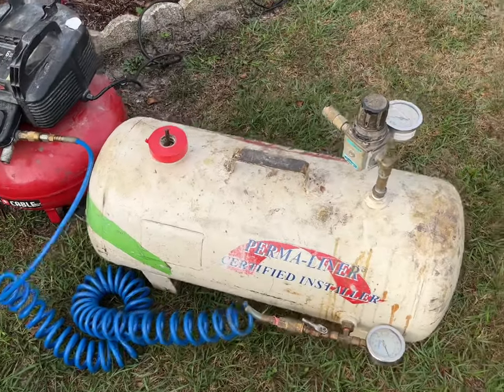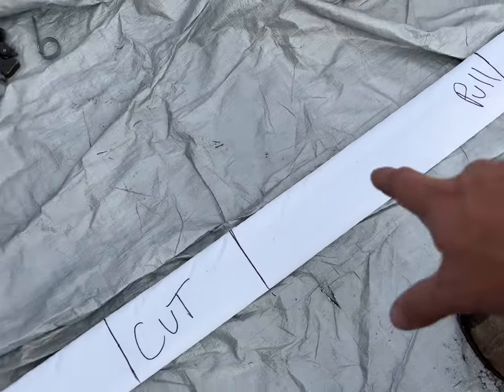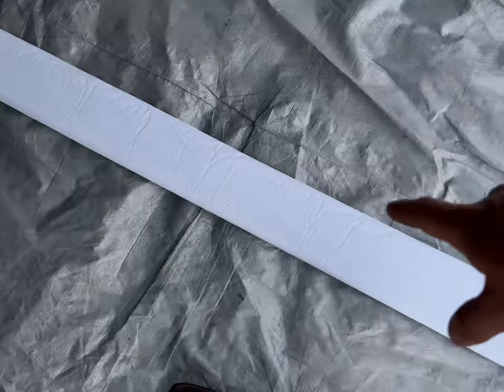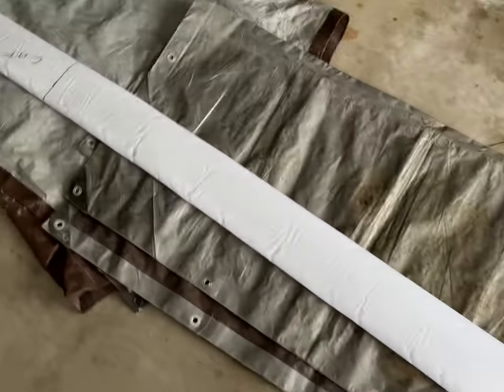When we're all done, we just air it up. Before we air it up, we have to wet this out with resin. And each one of these is a cutout for the fittings. You can't line over the fittings or none of your fixtures will drain.